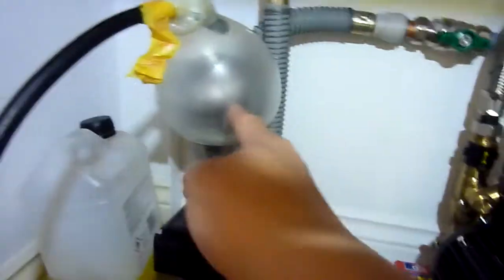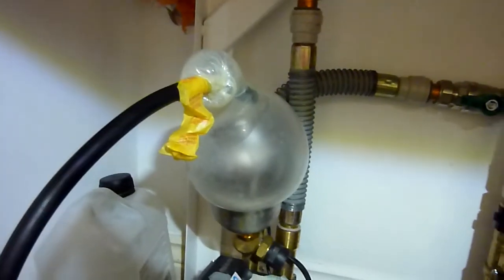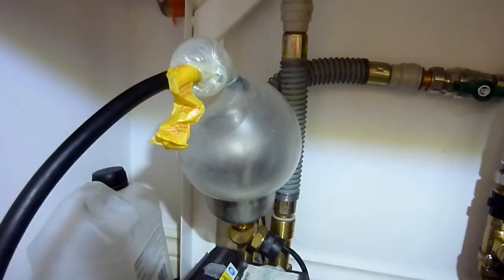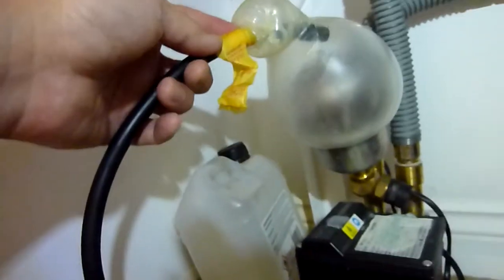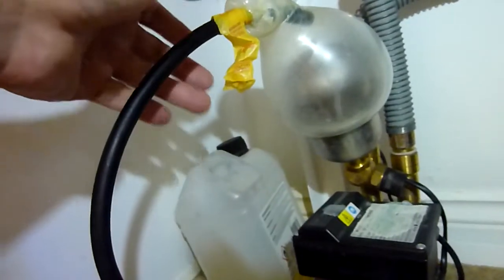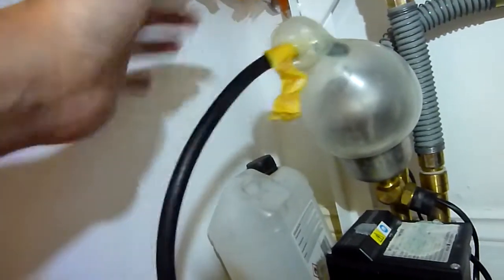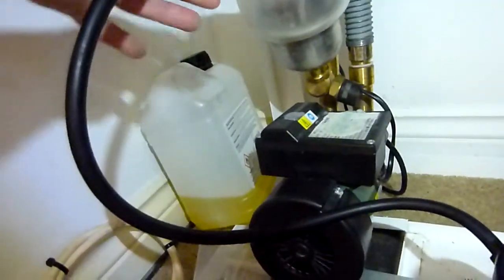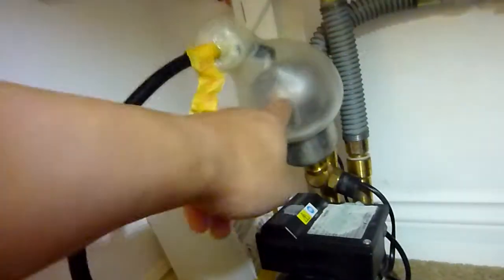This is the reason why I'm doing this — when these pumps lose pressure in these pressurized containers here, don't go playing with that if it's working. It will lose the pressure and the pump will switch on and off by itself without any provocation, without turning on the taps. Fingers crossed if this works. I've only got masking tape there and the air is holding — this is just two condoms in there. The nipple end with a tiny little bit of the nipple cut and insert this normal car tire pump in there, taped it up a little bit. I should really use electrical tape but I haven't got any. This tape seems okay, it's not leaking out.